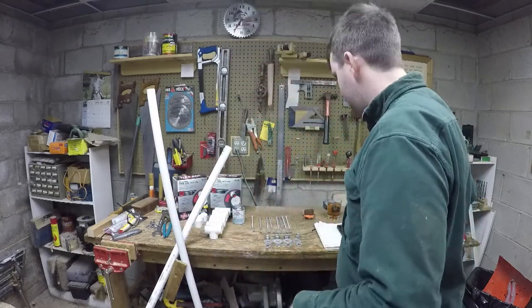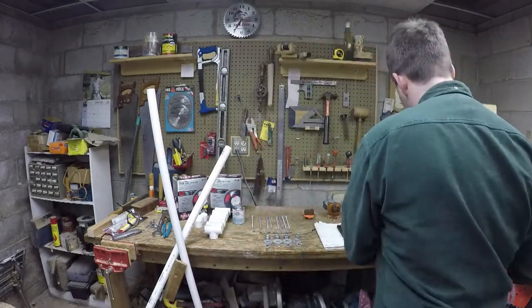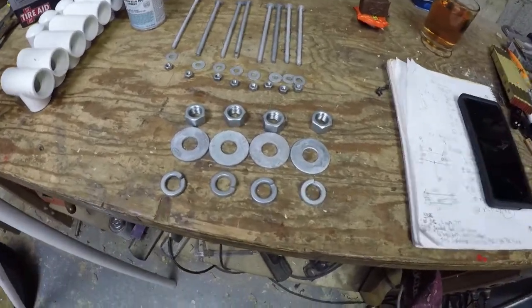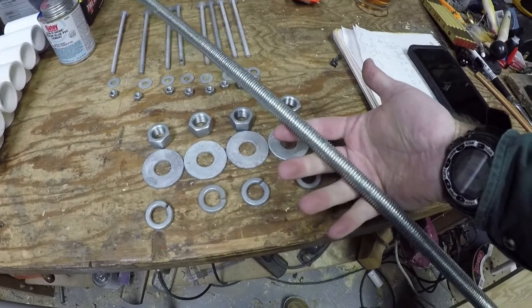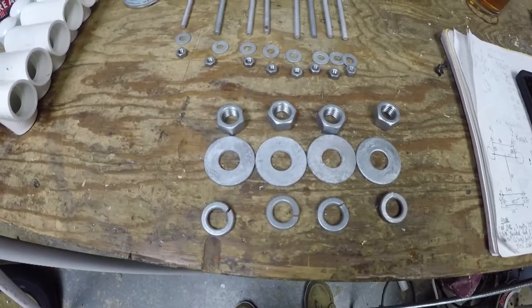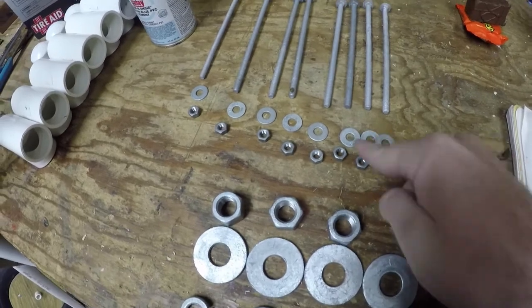For the rest of the hardware, you're going to need plywood. You need to make four ten-inch discs of plywood, about half inch thick. Then we have five-eighth inch nuts, washers, and lock washers for a five-eighth inch rod — a three-foot threaded and zinc-plated or galvanized rod. And then eight quarter-inch, six-inch long bolts with accompanying nuts and washers.